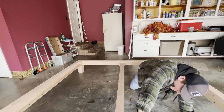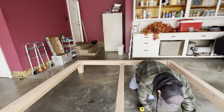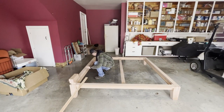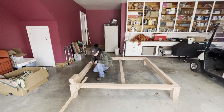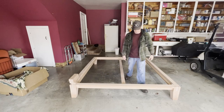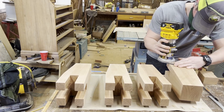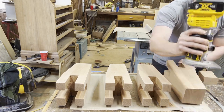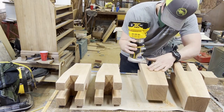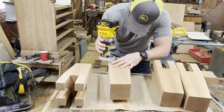So I'm measuring for that now. Luckily I had a couple of pieces that were exactly a half inch from scrap where I ripped down the sides. I glued, brad-nailed, and screwed those half-inch pieces on top of the braces I had installed by mistake. Then I cut the legs for the middle brace and went ahead and rounded over the outside corner of each leg using a palm router with a half-inch round-over bit — it's not as big a round-over as a typical castle joint bed, but I still think it looks pretty good.